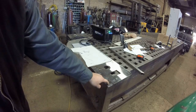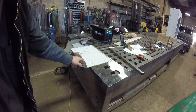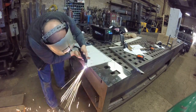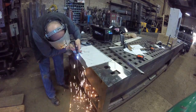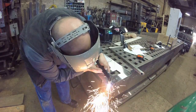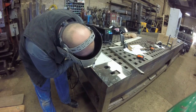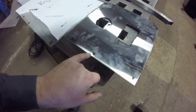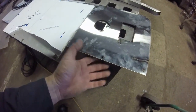My final test is actually going to be to blow a couple holes in here for screws. Instead of getting out the drill, I wanted to see what it would be like to blow a hole through a piece of 16-gauge. You can definitely see how fast this cut out some quarter-inch diameter holes. You can make slots, holes, whatever you want — those actually went very fast with very minimal warping.